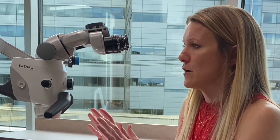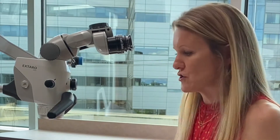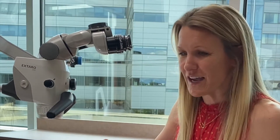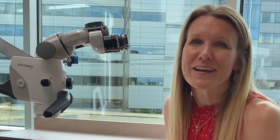The scope is almost set up for use but not quite. In the next video I will cover parfocaling, which will allow you to go through the various magnifications and still get a crisp image at all magnifications — both high and low — because as you go to higher magnifications the depth of field shrinks. We'll walk you through that in the next one. Thank you for joining me — if you have any questions please reach out and I'd be happy to help.